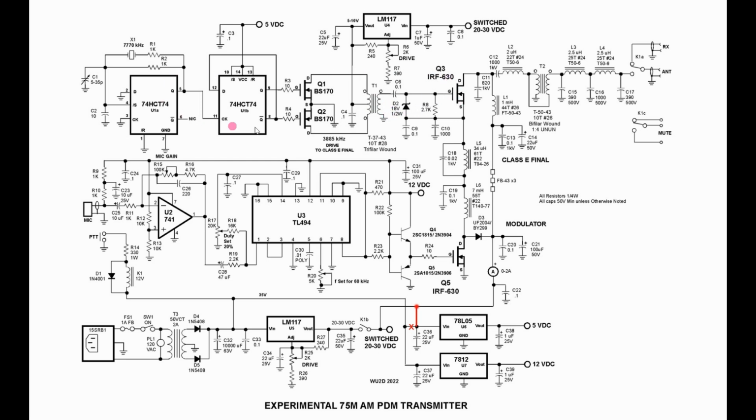So I was never totally satisfied with this system, and I did not optimize it like I did with the bipolar. We had to change capacitors on the output. Turned out our capacitors were overheating. So quite a bit was learned up here in the Class E chain.